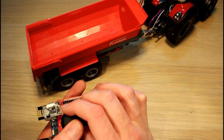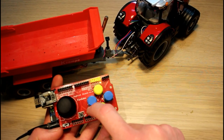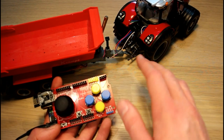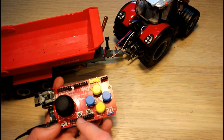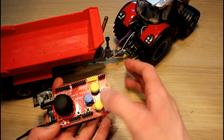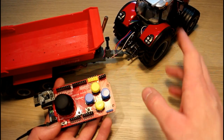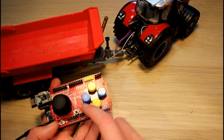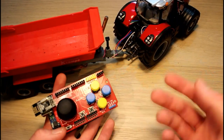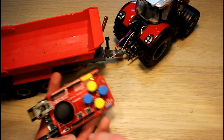When you flick back to drive mode, the lifting arms stay locked in place and you're able to drive — I think that method works pretty well. If you wanted to add another control, say a loader, you could click E once to go from drive mode into lifting arms, click E again to go into the loader, and click E again to return to drive mode. Because you have the Arduino, you can just keep adding systems and looping around.